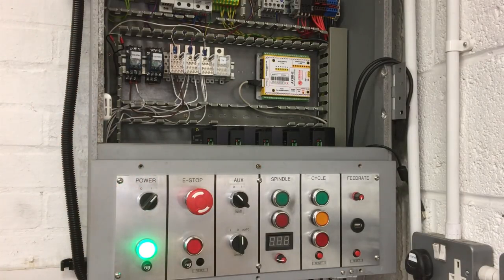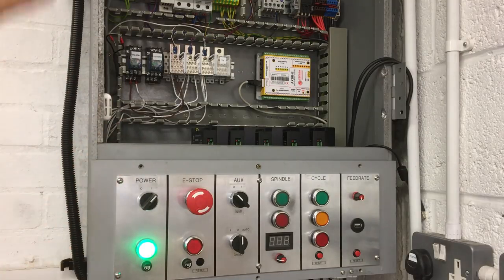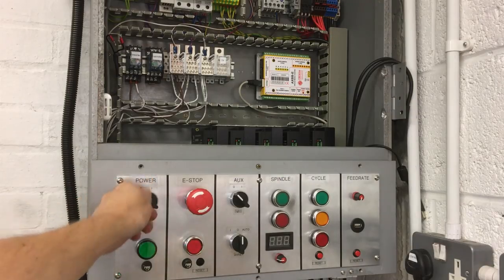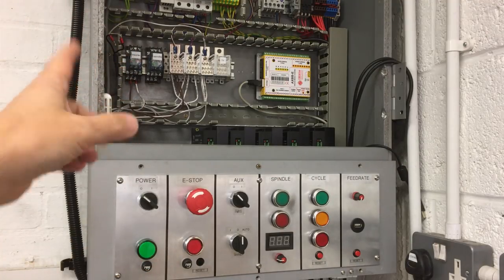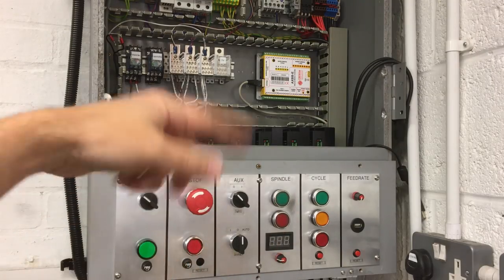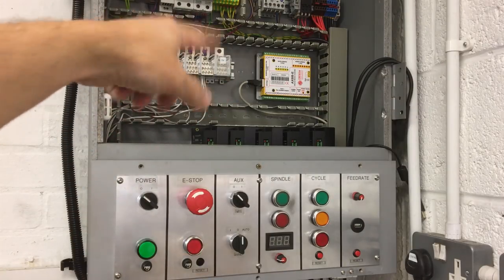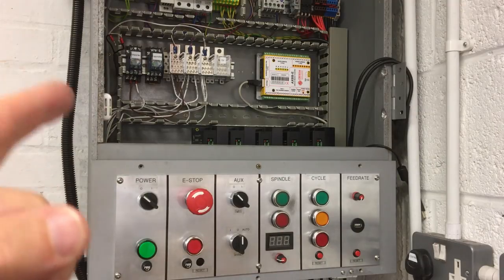Right, I think we'll end on that success tonight at least. It's just gone midnight and I think I need to go to bed. So, good progress there. Got it wired up, got the power working now. Now I've got the light hooked into the right terminal. And we've got our reset working. It doesn't latch yet, but that's a simple matter to get working. The lights work, the pump works. This e-stop would work, but the one on the machine doesn't because I haven't got that wired in yet. But it wouldn't go anywhere because it's not all wired into the main e-stop system. So I'd call that good progress.